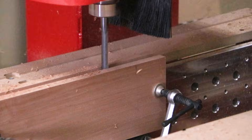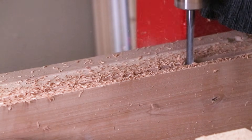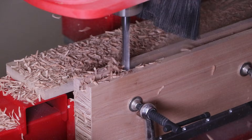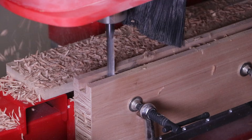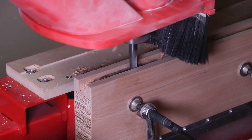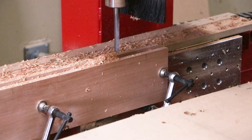The other vertical workstation and horizontal workstation will be shown later on in the video. Now the design of this door is going to be solid wood through and through. So I need to glue up centers for raised panels as well as produce all the styles and rails. The joinery was slightly different than what Tracy did — his was just standard mortise and tenons to create the outer frame design. I had to create these dado slots going along each style and rail for the raised panels, and I took the same concept and added those deep two and three quarter inch mortise and tenons so that this door is structurally sound and will last a really long time.